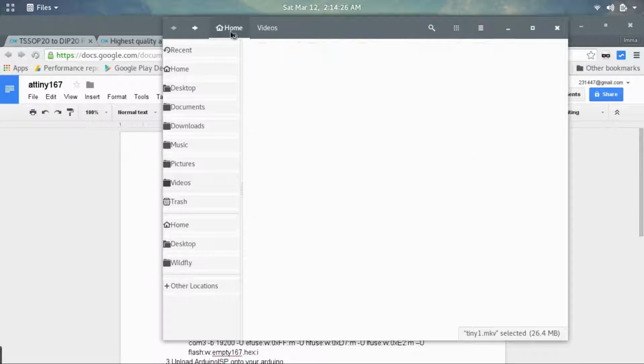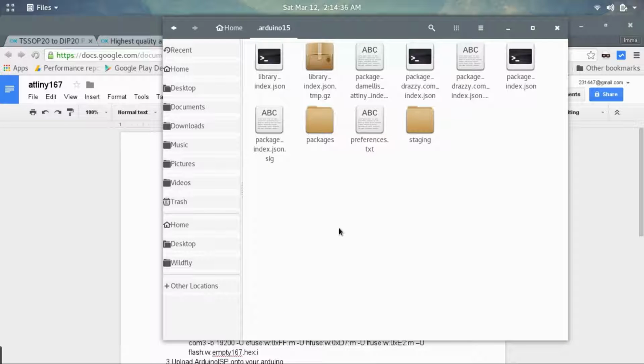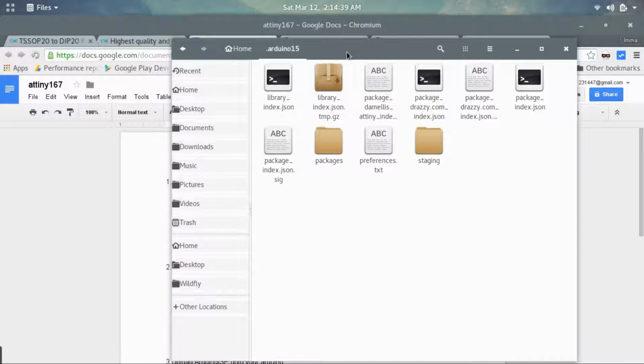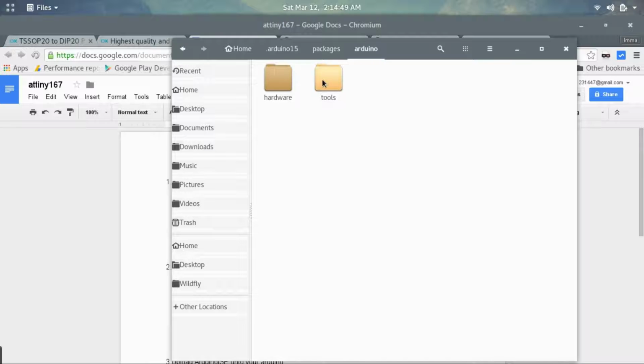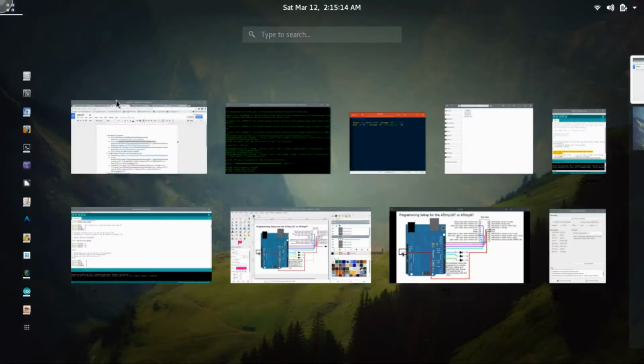So for example, in your home folder you should have an .arduino15 folder, and you may need to enable show hidden files as a setting in your file manager to get to this. Then go into packages, arduino, tools, avrdude, and then etc, and then you finally get to avrdude.conf. You can press Control L to see the location. So I'll leave these two locations in the description.